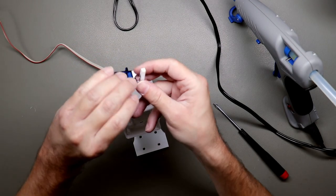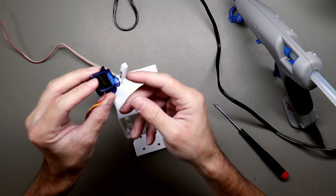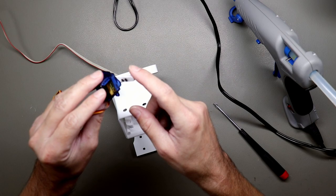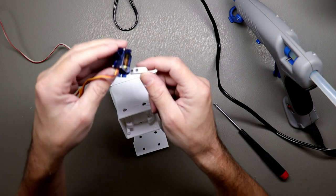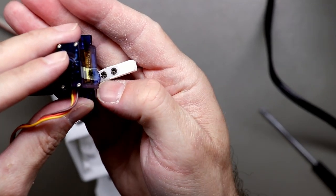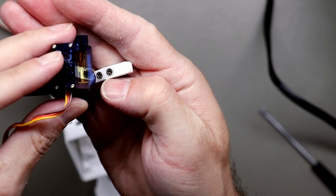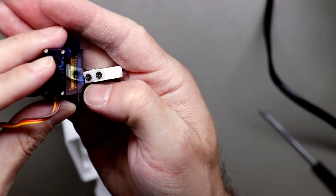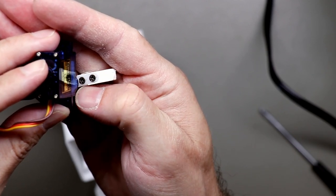So this is the servo, and here's the little arm. I will also put the file for this in the description below. And you may need to, let me zoom in a little bit. The holes in the little arm that comes with the servo, you need to drill the holes a little bit bigger. Otherwise you may break them when you put in the screws.